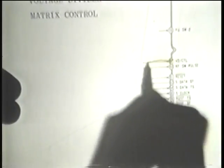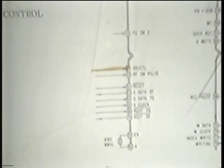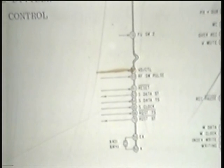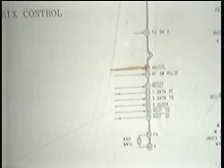And I've noted here the pin 67. Where is it? Here. Vertical drive stroke control. The system control, of course, reads the control pulses for editing purposes, and it's for counting purposes and so on. The control track pulses are kept an accurate count of in the main IC.